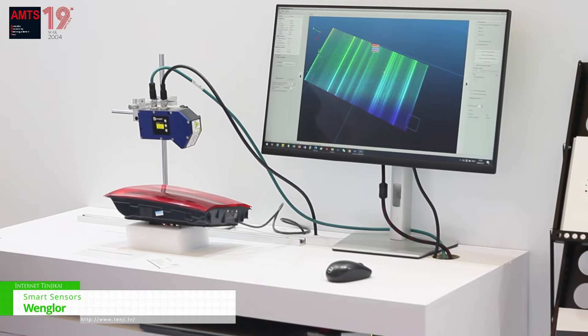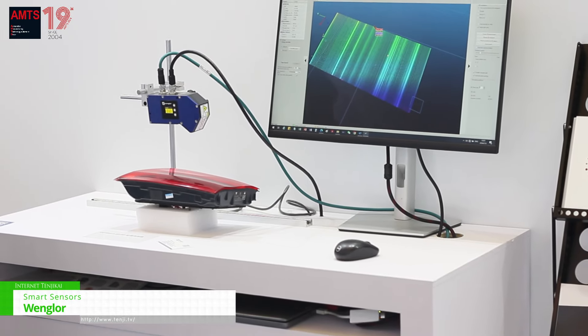The OPT3013 is also a laser triangulation sensor that offers a unique feature. It utilizes UV light — which you can see here in the bright blue — that is capable of doing laser triangulation on transparent materials like polycarbonate, which is extensively used in the automotive industry, especially for headlights. This enables our customers to create a unique car body shape that would be impossible to maintain in production for every car with conventional technology.